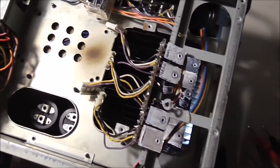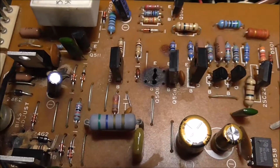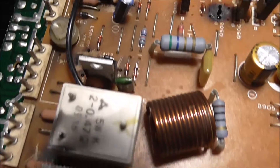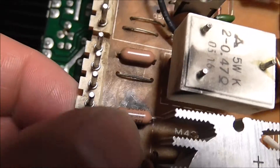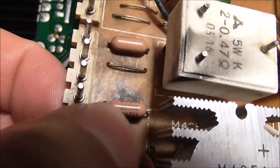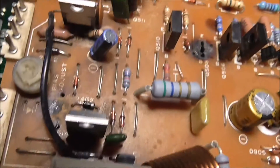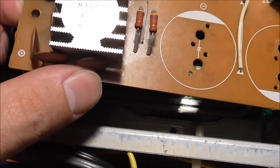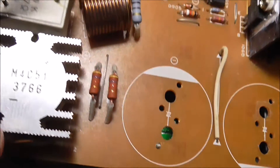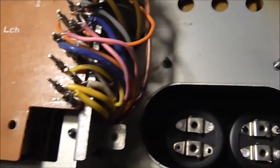I'm hoping this little bias diode is good, because these are very expensive — about $35 a piece for a new one. My meter can test up to two volts on the diode setting, so I should be able to test that. All these transistors — I don't know if they're any good. If those wires were swapped around, things could have gotten shorted very quickly. I'll have to test those transistors and other components. On this board there's an area where there's definitely been some burning and scorching — burn marks on this emitter resistor, burn marks down here on the board.